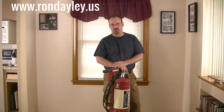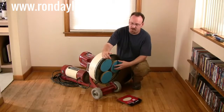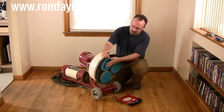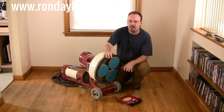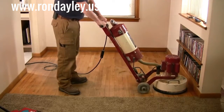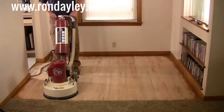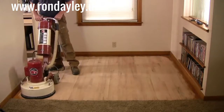There's actually a variety of different types of floor sanders you can choose from. The one I've got has three rotating pads on the bottom — seven inch discs that just peel on and off. Because it orbits on the inside of this big canister but also spins in a random pattern, you don't really have to worry about the grain pattern on the floor. Another advantage is that it isn't likely to gouge the floor, so you don't have to be in a big hurry to move the machine. You can spend a little extra time on problem areas — lift up on the handle to take the weight off those wheels and put it on the discs for the best results. Be sure to change pads as often as you need to.